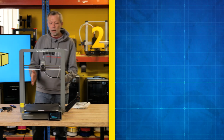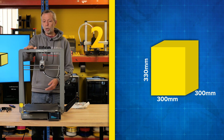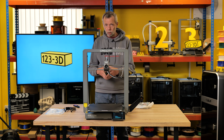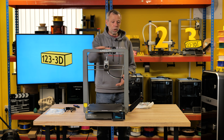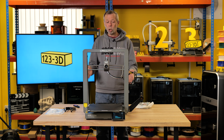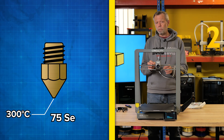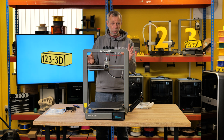Now we're pretty much ready to talk about the spec. We have a build plate size of 300mm by 300mm, and we can print up to 330mm high — which puts this machine 30mm higher in print capability than the K1 Max. Maximum speed is 600mm/s, however we strongly recommend printing at only 300mm/s to ensure the machine runs smoothly and you produce the highest quality prints possible. Literally, 600mm/s would be draft quality prints. We have the direct drive extruder, which produces a maximum nozzle temperature of 300°C — according to Creality's stats, achieved in 75 seconds. 4.3-inch touchscreen display.